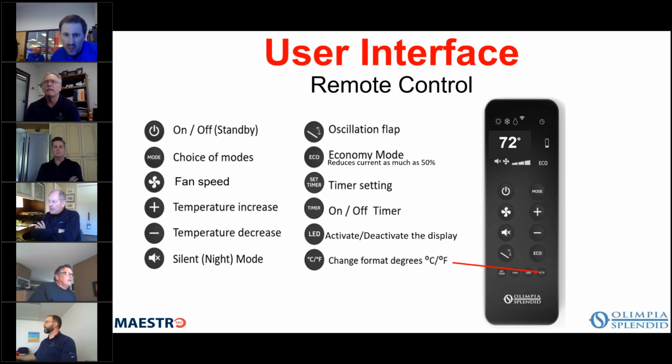Jack, in the heating mode, when it goes into defrost, how much condensate, how much water is actually produced, do you think? Well, that's very application specific because it depends on what the humidity level is of the air. Of course, as air gets colder, it holds less moisture. But if you have significant runtime, say between 30 and 40 degrees, you'll have more condensate than if you have significant runtime at 20 or 10 degrees, okay?